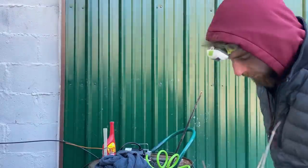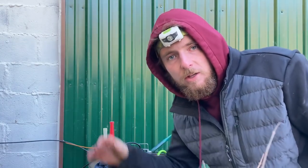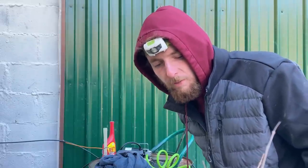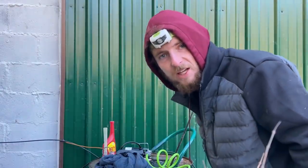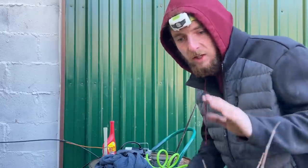All right, so what I'm gonna do is fill up this can, and I'm thinking maybe the pump got weak or something and it can't pull it up over this 8 foot high peak, you know, to bring it back down into itself. You would think once there's a siphon going, it wouldn't lose it, but for some reason it seems that it's lost it and I cannot pick it back up. So we're gonna fill up this tank and see if the furnace can pull fuel off of a tank sitting right next to it at ground level.